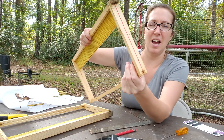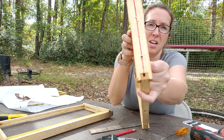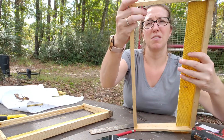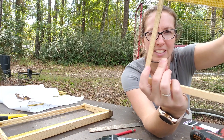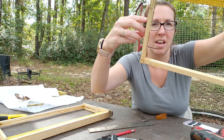I use a quarter inch drill bit — a quarter inch is the perfect size for this. It just barely doesn't go all the way through, it's flush. So if you pull it this way you can see it's flush on the side, it's not sticking out the side of the frame. Towards the inside of the box it's just a little tiny nub that gets stuck on the edge.